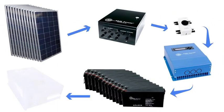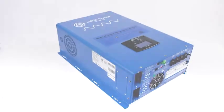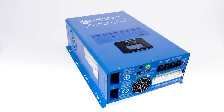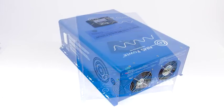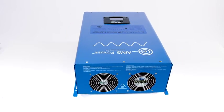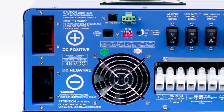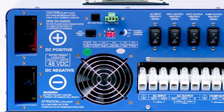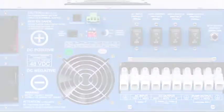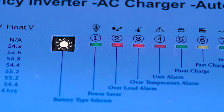The battery bank provides power to the inverter charger. We include the Aims Power 12,000 watt Pure Sine inverter charger that outputs split phase 120 and 240 volts AC. This unit has a 48 volt DC input and a 240 volt AC input for charging and bypass. The inverter has a powerful 36,000 watt surge for 20 seconds and is built with a low frequency platform. A convenient battery charger is built into the inverter and includes charging profiles for eight different battery technologies including lithium.